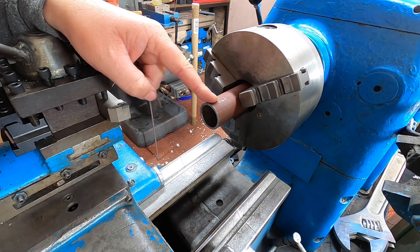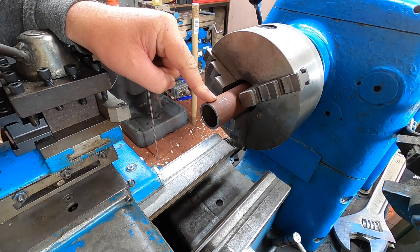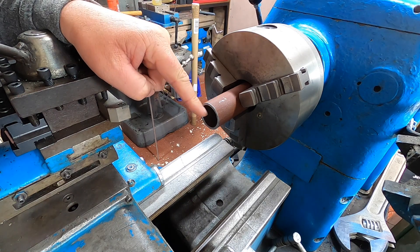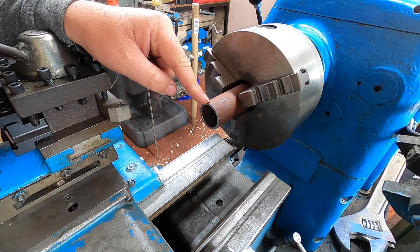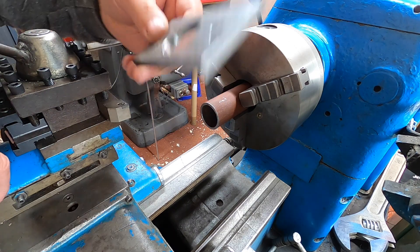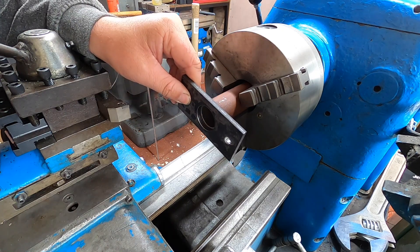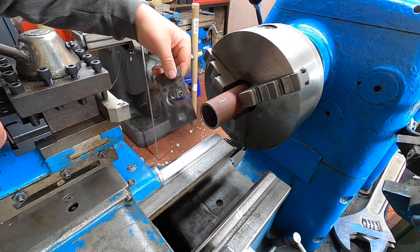So I've got this piece of one inch tube, which is going to be the column for the brake shaft. I'm just going to face off the end so it's square, and then I'm going to see about machining the diameter down so I can fit that on it so it sits square and I can weld it easier. Let's see what happens.